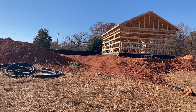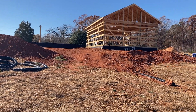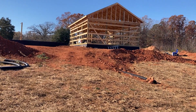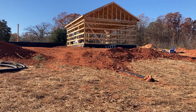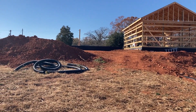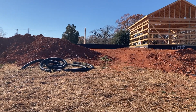That is our waterproofing rubber membrane on the wall. I did it both for the house and the slab on the garage because I want that slab to stay dry. We put 6 mil vapor barrier underneath the slab on top of the stone before we poured the concrete, and then I sealed the outside edge of the concrete with the same rubber coat that we used for the crawl space on the house. So that is one step against fighting water intrusion into the crawl space.